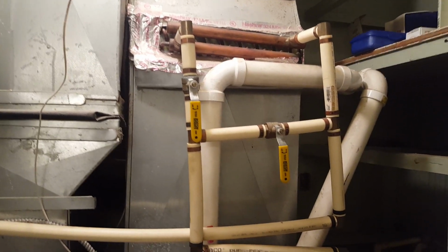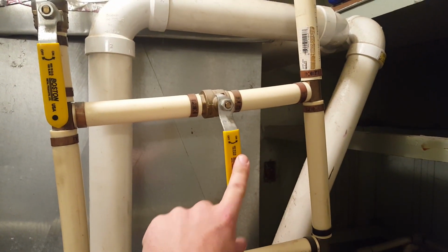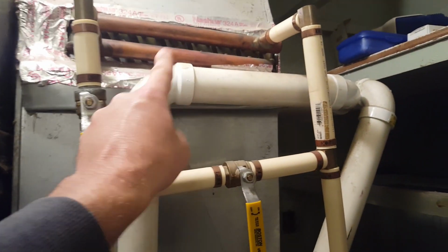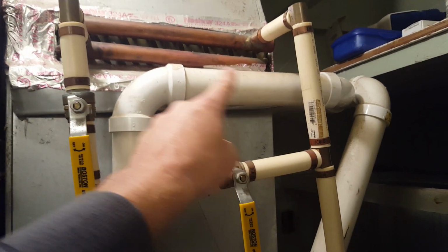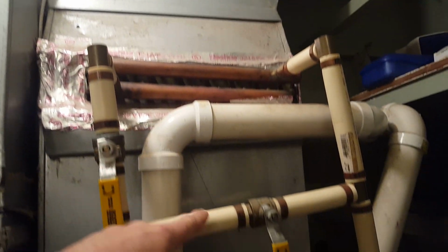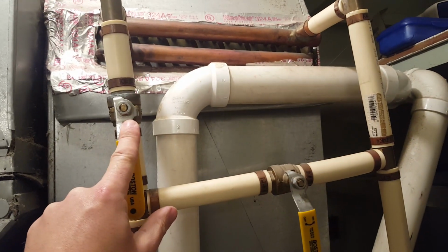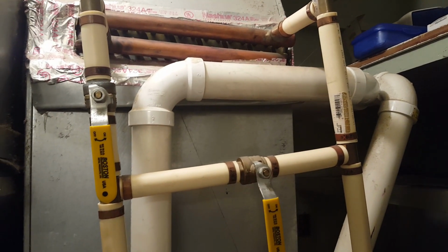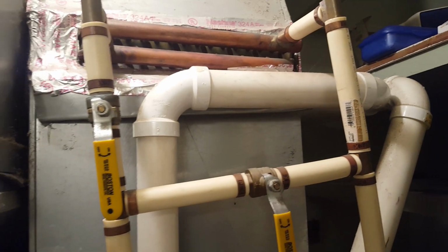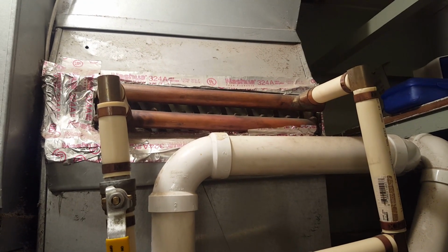All right, the inside mess. I can't wait to redo this whole thing here, but this basically diverter right here we've got closed. This would divert it away from the heater. This is the heat exchanger that goes in the ductwork, so the air blows through there and out into the house. You can turn this on and close this, and this will just heat the water. So if we just wanted to run it for hot water, that would do that.